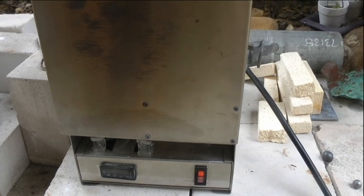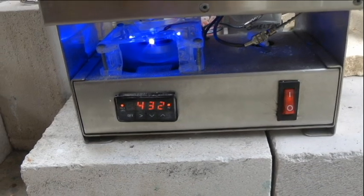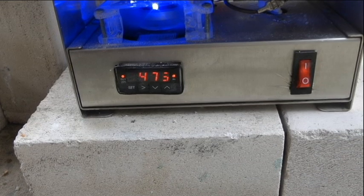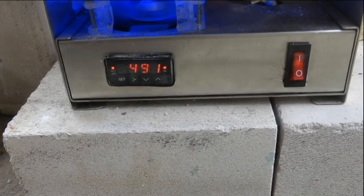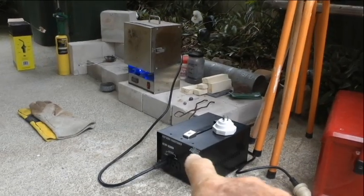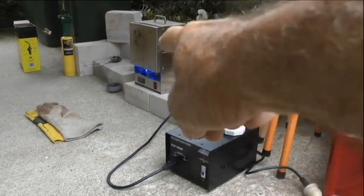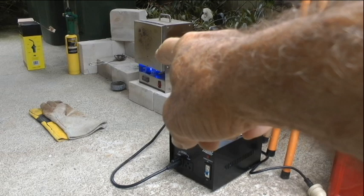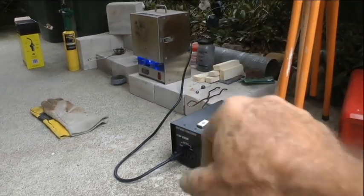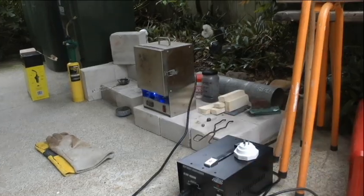It's got to get a bit of oxygen to it, so I'll fire it up. I've got a preset on about 1780 — this is just rising now, at 470. I've set it to 1780. I've got a drop-down transformer, which is important because it just cooks the wires too much here in Australia — we've got 240 volts. In the States it's only 110, or 120. So we need a drop-down transformer to run the tabletop kiln.